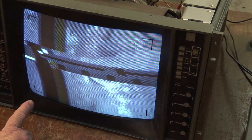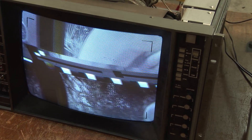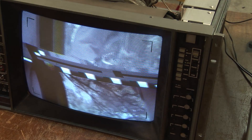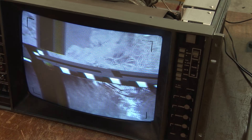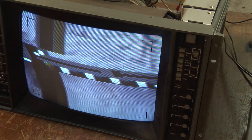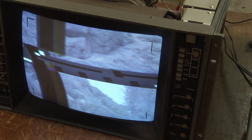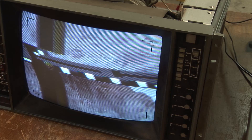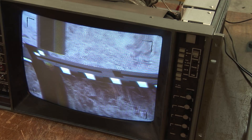The first series here is the color stripe — that's the one causing the color burst to screw up, which is designed to mess with the color on your recording. You've also got a couple of keying pulses here, detected by more modern VCRs and DVD recorders, and this keying signal tells them to shut off and not allow you to make the recording. Now we're watching the uncorrected video coming right off the tape, and I'm going to switch the time-base corrector on to show you what it does to this signal — and it might surprise you.